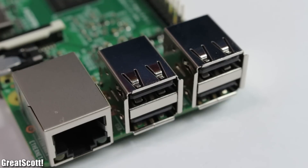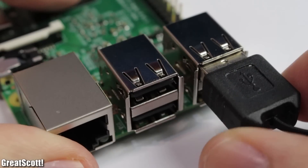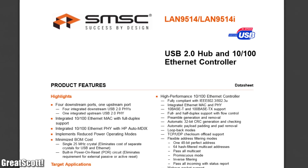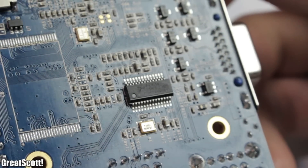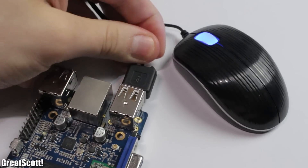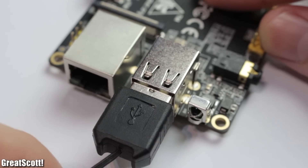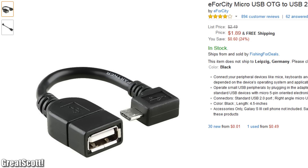All of them have USB ports, but I think four ports are mandatory nowadays. The Raspberry solved this with a LAN9514 USB hub plus Ethernet IC. The Orange similarly uses a FE1.1S IC — but surprisingly, two of the four ports won't work with the official operating system from the developers. That is a definite fail. The Banana has only two USB ports, or three if you count the USB On-The-Go port, which the Orange can also offer.